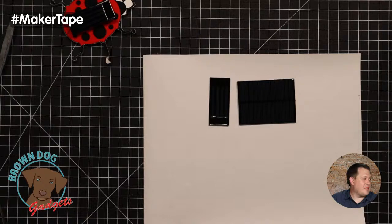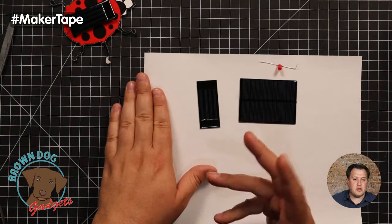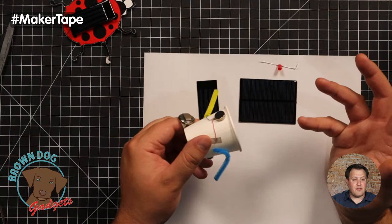But back to solar panels. All right, so anyway, 6-volt, 2-volt. Your standard LED is anywhere from 2 volts, like this red LED, up to 3.5 volts. Your standard little vibrating motor, like this little self-sticking motor we have on this old Dixie cup guy or one of our Bristlebots, runs off about 1.5 volts of power. So a little 2-volt panel will do fine.